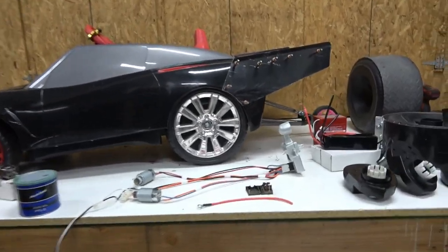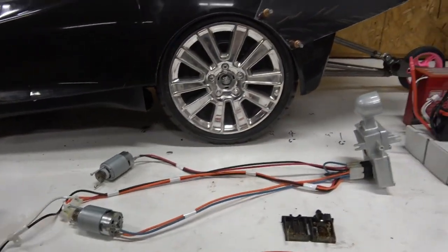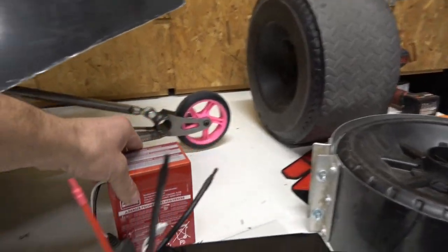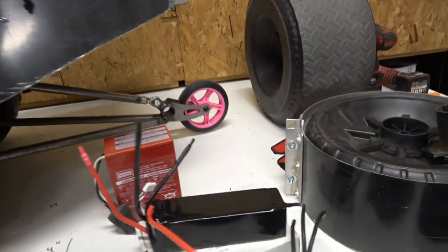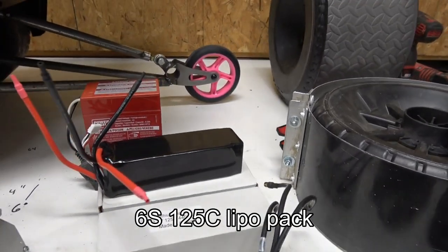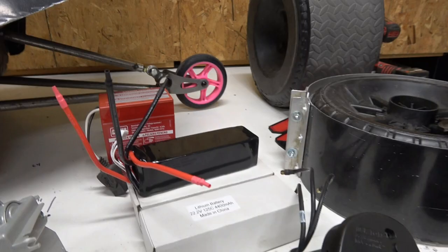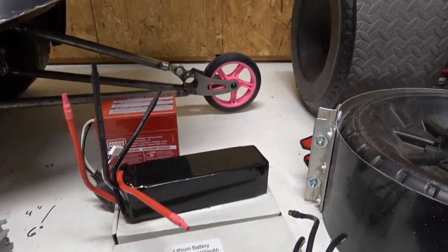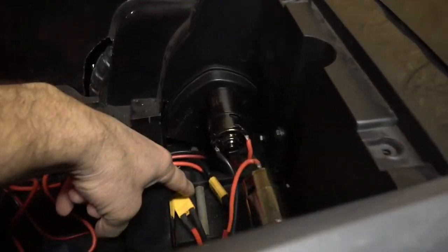Starting with the wiring — this is the entire wiring harness from the battery to the shifter to the motors, just ripped out, because it used to have a six-volt battery. In its place we've got this black box pack from John Metric over at Lone Star Performance EV. He builds electric racing cars and sent us these packs. It comes in the box and is mounted underneath the seat, using XT90 connectors to supply power to the new wiring.